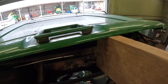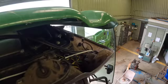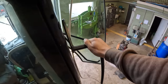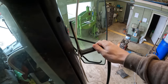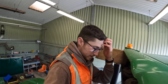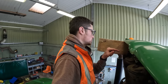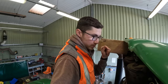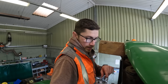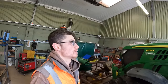We've laid this two-core cable all the way along and down and out the bottom of the roof tray down there, so that's now running down the outside. We've got the bracket undone here for the step handrail because the beacon bracket needs to go in underneath and screw that back on. But what I want to do first is just wire it up to the beacon and make sure it works. I've also got a load of fertilizer coming in about 45 minutes, so I'll see what I can get done.